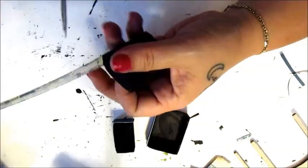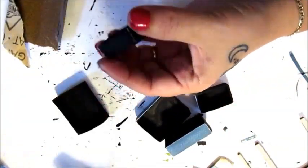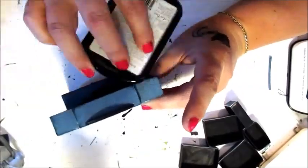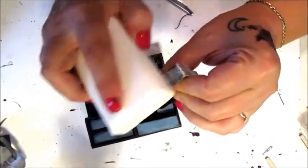Cover the front of the drawers now. Trim any excess and sand the edges. Darken any light edges that are showing. If your drawers are a little tight, you can rub a bar of soap against the sides — this really does help to make things move more smoothly.